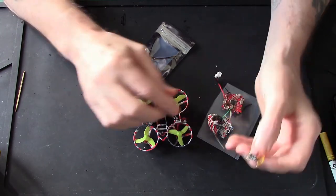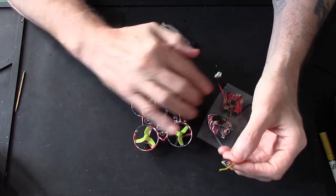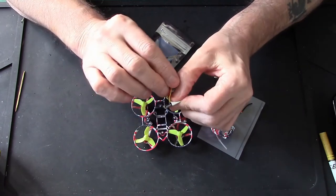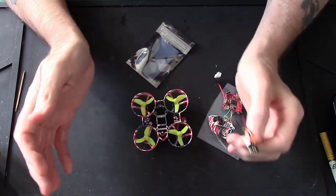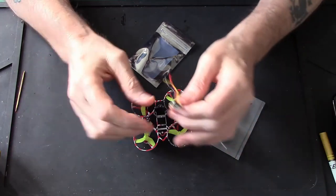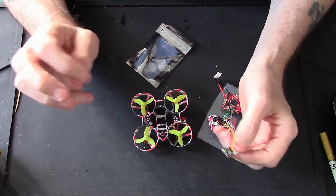Now, because it's a little whoop board, I haven't got any spare UARTs on this particular one, so I'm soldering it up as S-bus, but it'll still work fine so I can use my Tango 2. Right, now before anyone says there are other ways around it, I know, but to me this was the most straightforward way. So I thought, seeing as I'm doing it, I'll just knock out a video in case anybody else wants to do it.